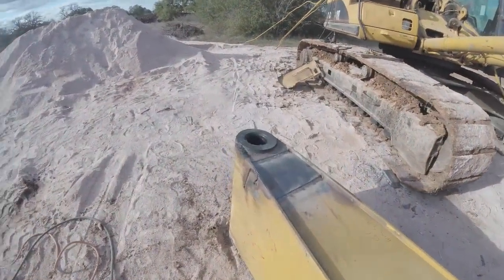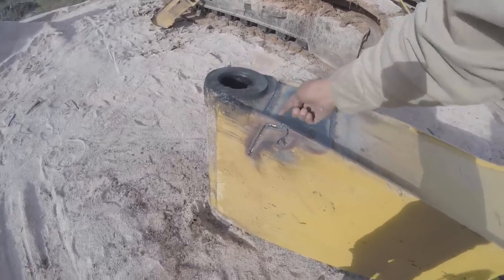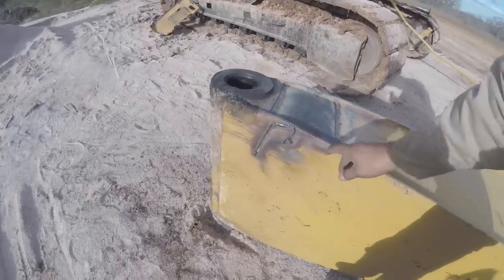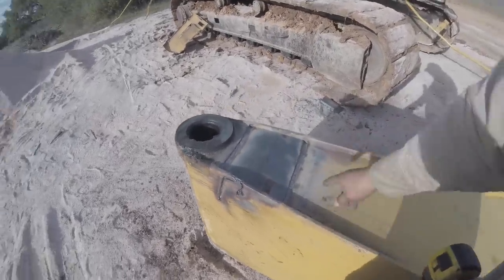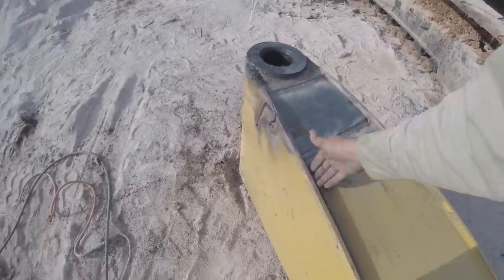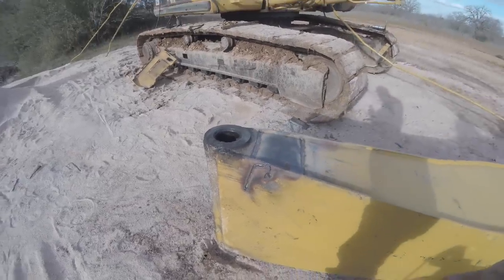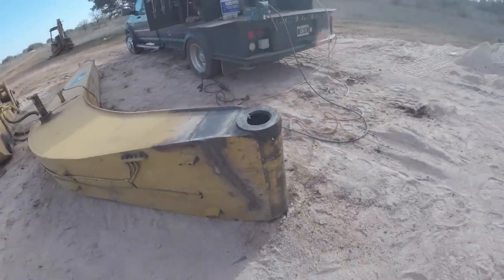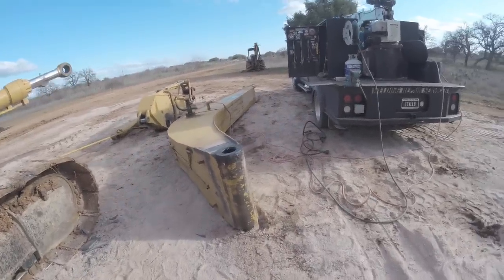Okay, so I had them lay it over on its side, and this is the mess that I made from this one. From the inside, I just welded a weld pass to try and bridge the gap. But being on this side now, what I'll do is arc gouge all that out, and then at least I'll have some material. I didn't put a backing plate on that one, and then I'll just gouge, continue that way. This has some cracks here, continue that way. And then just fill it all up. So almost there. Good thing I saw that. That looks like it's cracked there as well. So looking good. I already did that side. Fortunately, I can move it around. So it's not bad. All right, hang tight.